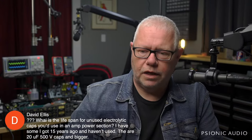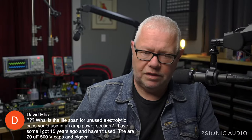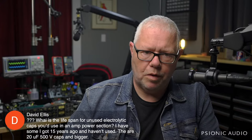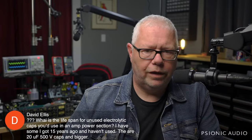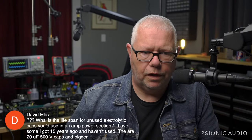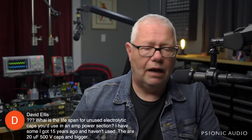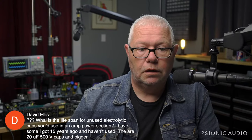I was talking to a guy the other day, and he's got all these nice amps, and he just doesn't play them very often. I said, well, make sure that you at least turn each of them on for like an hour at least once a month. Just keep those caps from drying out. Play them if you can. The worst thing you can do is just let it sit around unused. And that goes for new old caps in storage. I would not buy 15-year-old caps, even if they're never used.